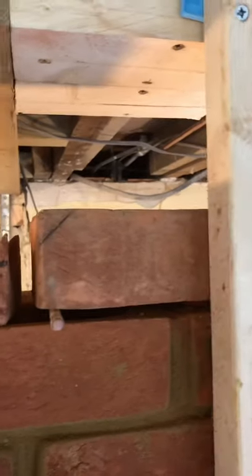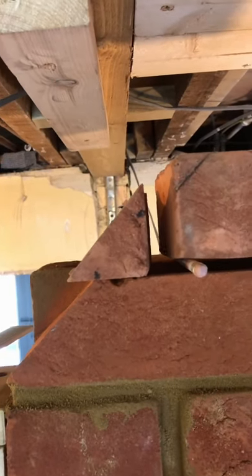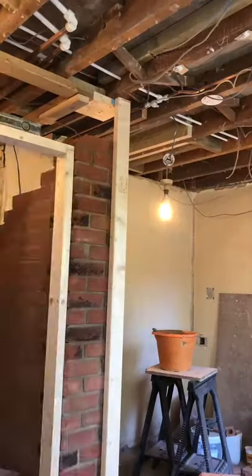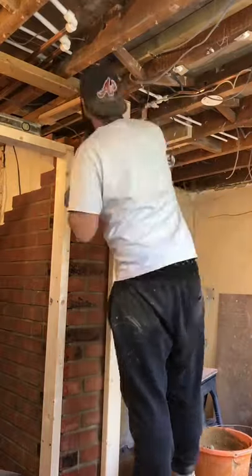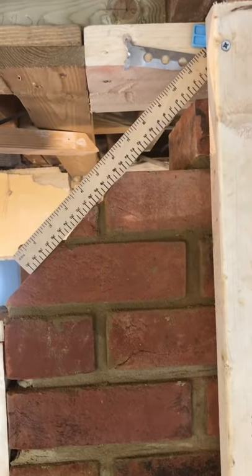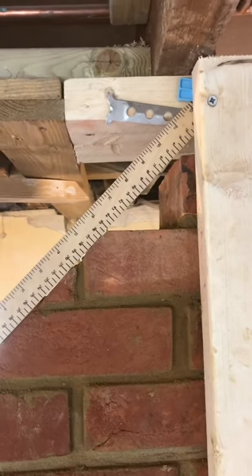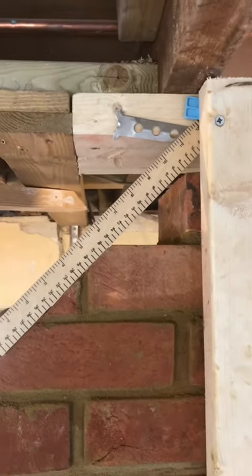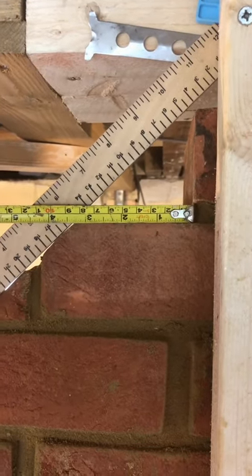The offcut of this brick I'm going to use to infill that. I'm going to put it more forward to mark it than I want, because when it raises up it'll get smaller. To mark that one I just held it in line with a brick there and marked it. This one I'm going to do by measurement, because of the pillar — the header goes in and it doesn't get affected by the angle. To try and put a brick in there and use the rule would mean having to cut a brick in half first and balance it, which seems pointless, so might as well just measure it. The tape is about half inch, so I call that one about 55mm, and this one here is about 72mm, so minus 10mm — we're looking at 62mm by 55mm.